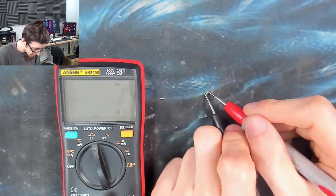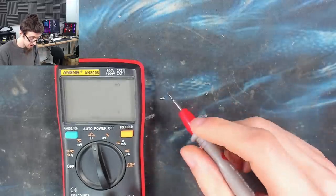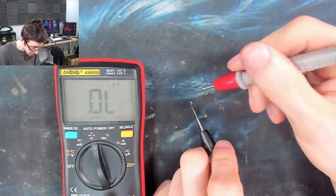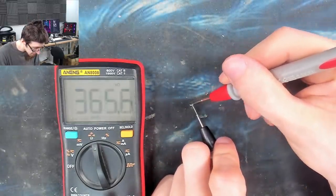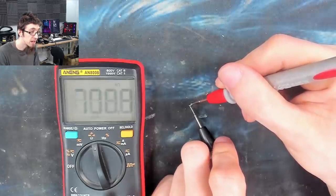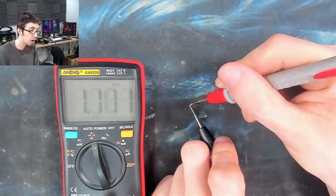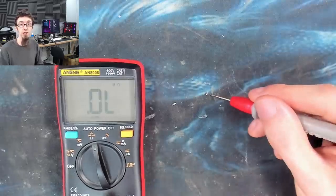This is going to be tough. Huh. We have a shorted capacitor at half an ohm. That guy's dead. So what about this one? Whoops. And that one, as you can see, we have kilo-ohms and rising. So it's absorbing power and the resistance is building up as it absorbs power. So that one is behaving as you would expect. And this one is dead short circuit.